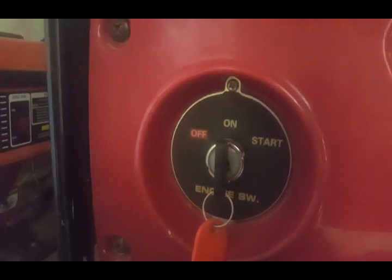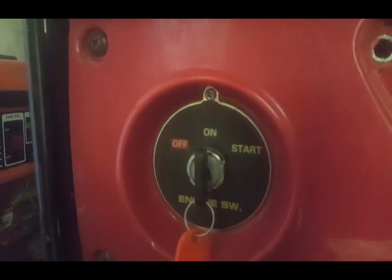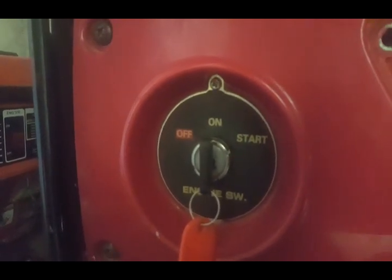So yeah, there's a standard Centurion gate controller, you know, 4-channel. I only needed 2 channels, but I had this 4-channel, and it's using standard remotes, and then 3 relays. This generator's got 6 wires on its key start. 2 of them are bridged out to start, and the other 2 pairs are bridged out on the stop. So just match that with 3 relays.